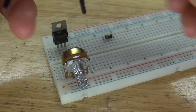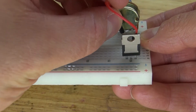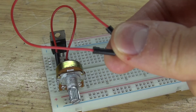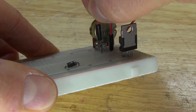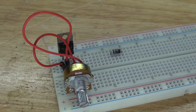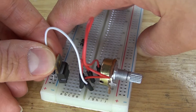Next I'm going to take this jumper cable and connect it over to the base of the transistor, and connect the base of the transistor over to the center pin of the potentiometer. Next take another jumper cable and connect it to one of the outer pins of the potentiometer — either the left pin or right pin, it doesn't matter — and then connect that jumper cable over to the collector of the transistor. Next take another jumper cable and connect that to the final pin of the potentiometer, and then connect the other end to the negative rail.